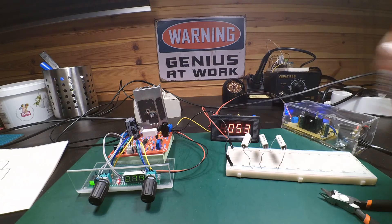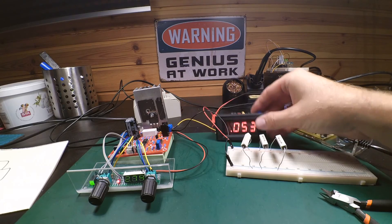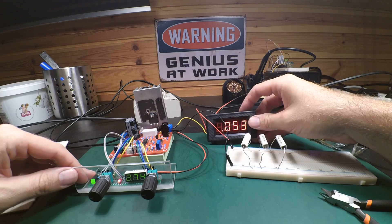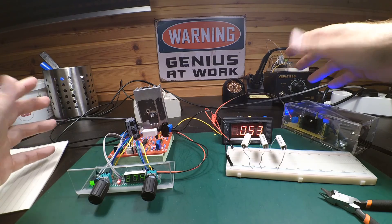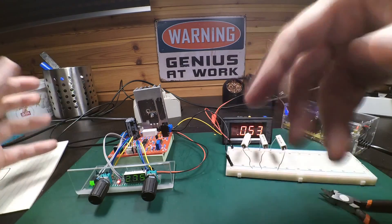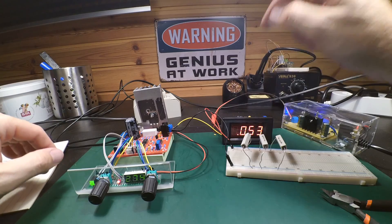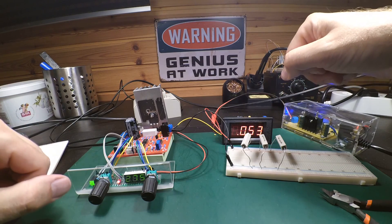So I might take the AC voltage from the transformer, rectify it with a bridge, and use a 5 volt regulator to power this meter separately, because using it from inside the power supply creates ground loop problems. But this little current meter works really nicely for 4 or 5 euro. I have to see how to put all this together in the front panel. I'm quite pleased even if it didn't end up as I wanted - that's half the fun for me. I want trouble, troubleshooting, and learning things. Good luck if you want to build this; hopefully you've learned a bit about current measuring and how to put it in your circuit. See you later.